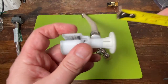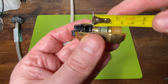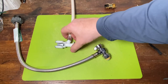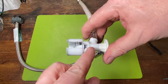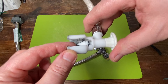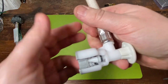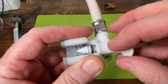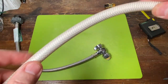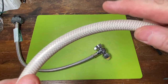Another thing I wanted to check is how far this actually went in from the O-ring. It looks like it's about 3/8ths. After the O-ring, this one goes in about the same - 3/8ths pipe in after the O-ring. So it's a good amount. But if you didn't put that in long enough or you cut this pipe a little too short, you're just waiting for a disaster to happen. Obviously there's no quarter turn feature - this is a push-pull feature. And this is a PVC braided nylon reinforced line.